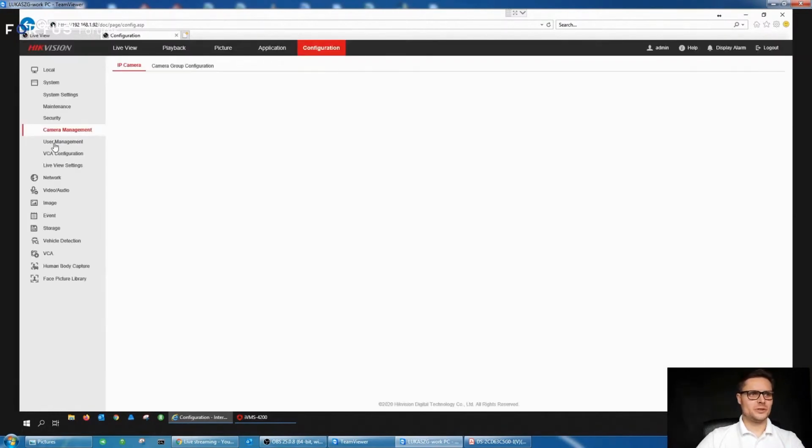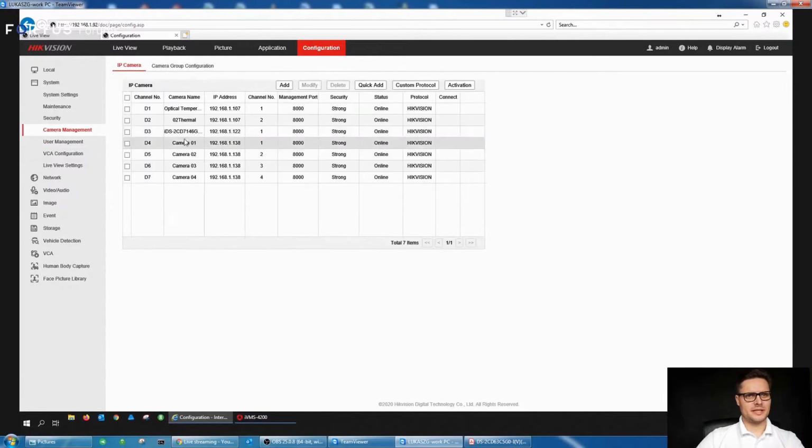But also when you go to the camera management, you should notice that it will take a bit more of the channels as well. When you look at the camera list, in the case of an 8-channel recorder, it would take 4 of my channels straight away. So that's another thing. If you like to use multiple channels, you need to make sure the math is right, counting how many cameras you're actually going to add in.